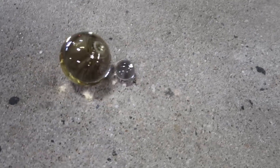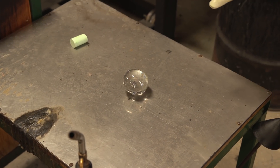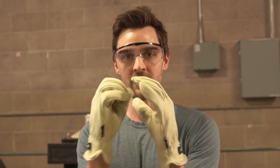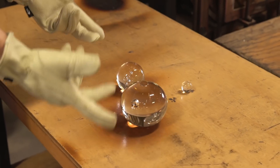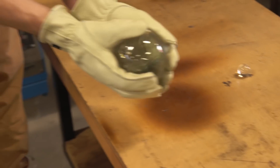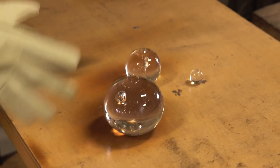It's been about a week, and the last time I was in here we created an unannealed glass ball. It's right here — it has survived. It's literally still intact, which, if you know anything about glass at all, is crazy. These things should blow up and explode within a couple hours after creation. There's a theory that it actually kind of anneals itself because of the shape — cooler on the outside, hotter on the inside, and it kind of works itself out. Over here we have three annealed glass spheres. They're not perfectly round, kind of spherical-ish. What we're going to do now is the drop test to see if they bounce or if they break.